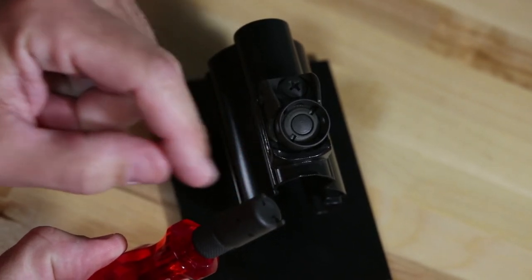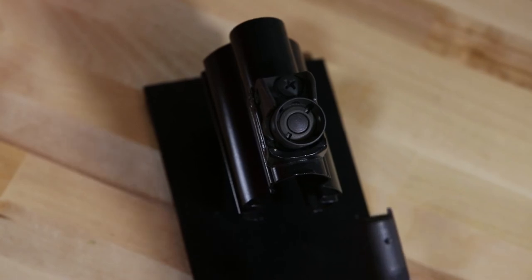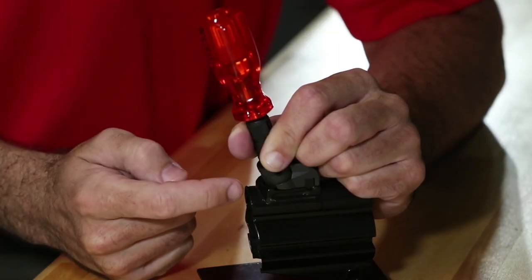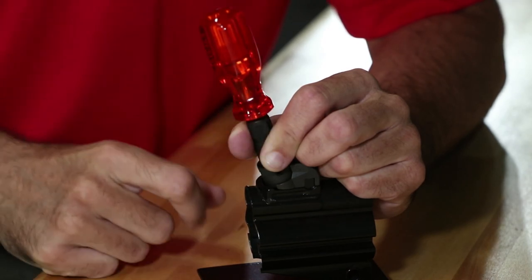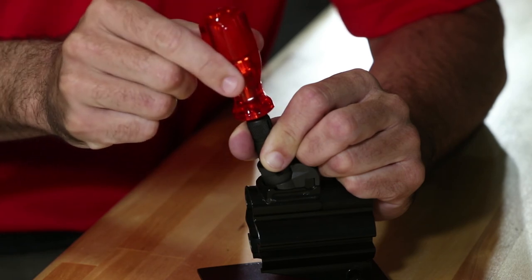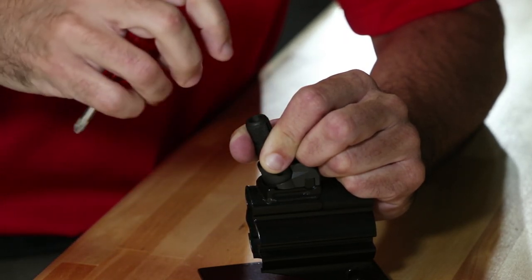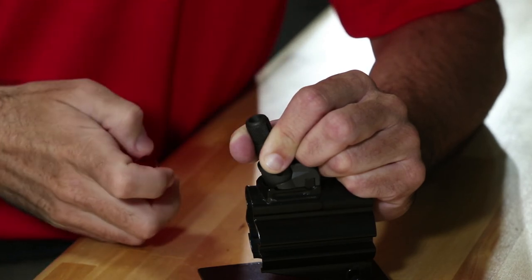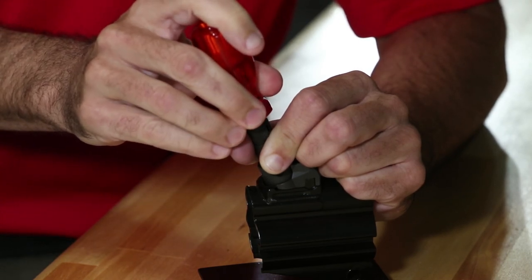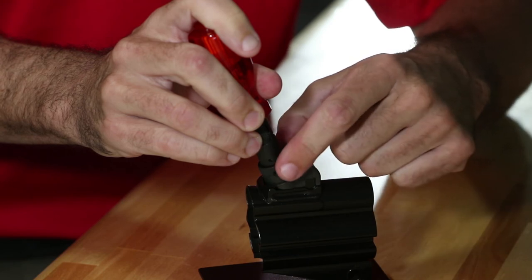The key is to interface the two detents on the spring cylinder with those two detents on the inside of the sight base. Attach your sight tool together, then align it straight down on top of those detents and you'll feel it fall into position. The tips of the spring cylinder tool sit over top and just to the outside of the two spring-loaded detents. With downward pressure of your thumb and forefinger, remove the Phillips head screwdriver portion of the sight adjustment tool. The clicking position shows that the tips on the spring cylinder tool have now captured the outside of those spring-loaded detents. Reinserting and fully forcing downward the Phillips head screwdriver now forces those spring-loaded detents inside, and removing your left hand, you can spin the elevation drum freely in either direction — there are no longer any clicks stopping it.